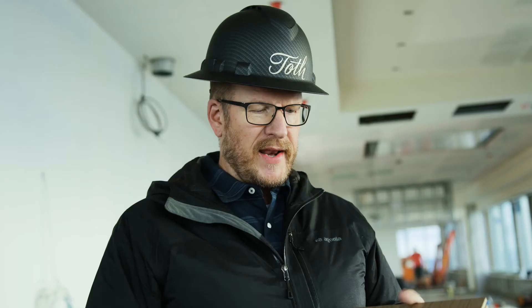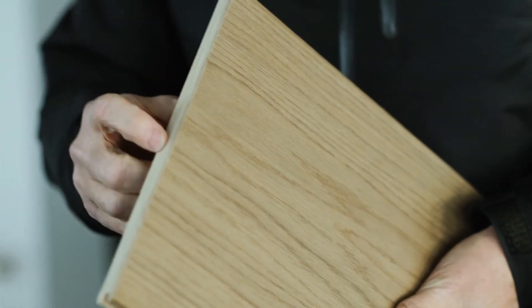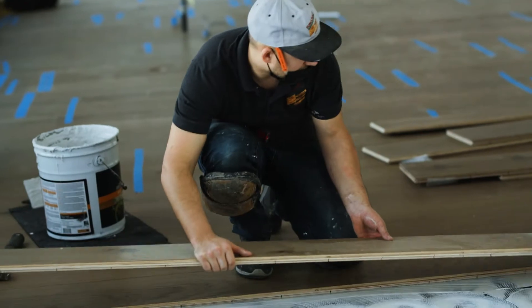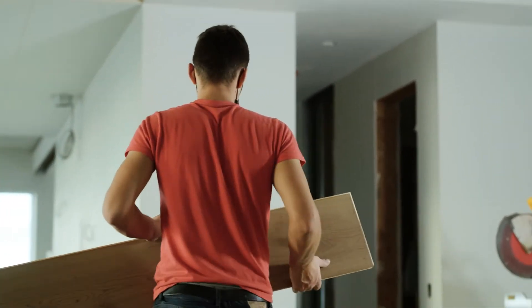The hardwood flooring is pretty dynamic — it's a 10-inch wide plank, which is quite wide. The way we're able to do that without cupping or moving is to have this engineered back, basically a multi-layer plywood back with a thick solid core veneer on top. There's a French cut oak wood with a waterborne finish so we don't off-gas and create unnecessary smells in the building, since there's occupancy now in the building.